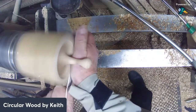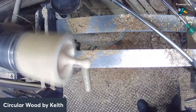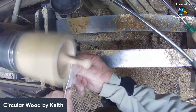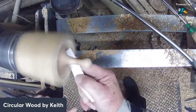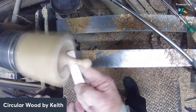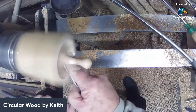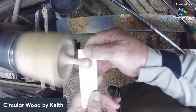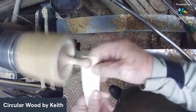It might be if it's green. Possibly, yeah, and if you know the person who's selling it. But generally speaking, burrs are not cheap. Generally speaking, you don't get a burr on yew; you get pippy yew. Because the burr itself actually extends all the way around the stem, trunk, branch, tree, whichever piece it's on, and it emanates right from the centre. Which is nice because then you've got that figure right the way through the timber, which is a nice feature of it.